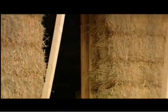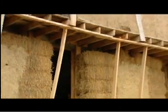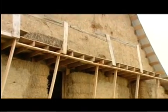Right. Do you have to have an existing structure to make it work? No, you do not. One of the beauties of this type of construction is that you can take an existing building, put a straw bale wrap around it, and have all of that added benefit of an R45 wall. That definitely reduces the cost of heating and cooling.